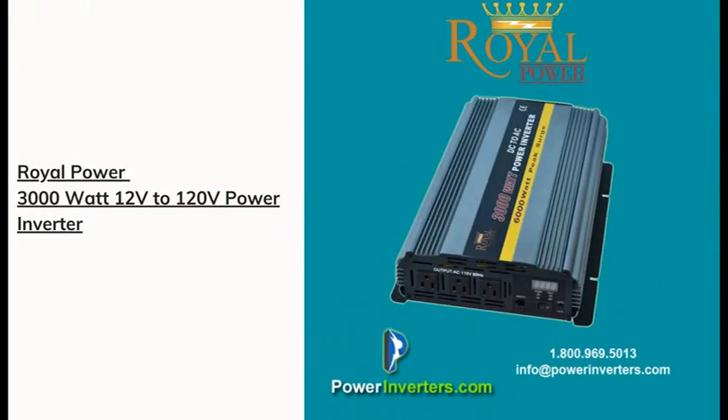If you do get an inverter that surges above that 24.25 amps — more than just a quick startup peak — it is going to cause the alarm mode to go on and cause quite a headache. Every time it has that surge, say a motor running one or two seconds in the 25 to 30 amp range, it is going to shut the unit down. So it is important to contact us and make sure you're getting the right piece of equipment.